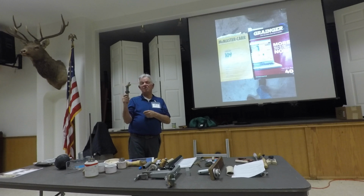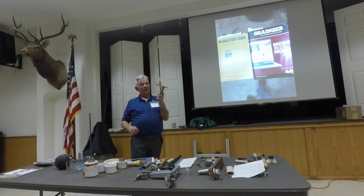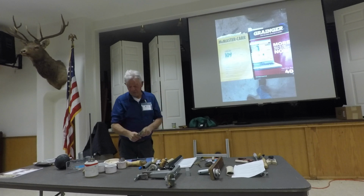This is good for a lot of other things, whereas if you buy it as part of the Trent Bosch, you can't take it apart and use it separately. This is just handy if you're going to do anything inside of a bowl to make sure that you're not skating around. It just gives you a lot better tool control. And the tool posts come screwed on, so you give them your tool post size, and you get the bar with the correct tool post, and that makes it a simple thing.